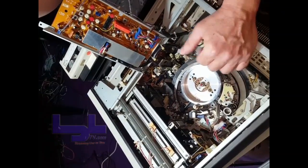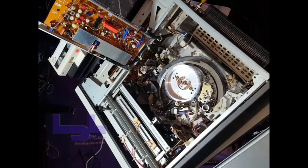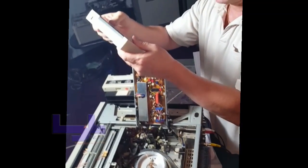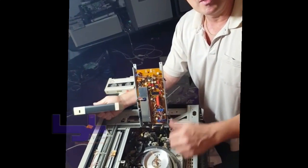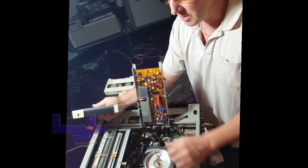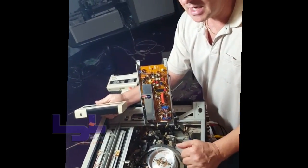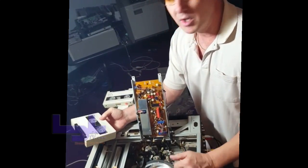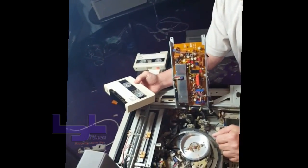There are a couple of ways to bake it. One way is to put the tape on top of portable hard drives — they're just warm enough but you have to let them sit for several hours. Or you can use a space heater: put a piece of metal on top on very low heat, place the tape on the metal, and about 15 minutes later it's heated up. Let it cool down slightly, put it back in, and the screeching will go away — all the stickiness dries up. That sticking is almost 99% of the time from a tape that needs to be baked.